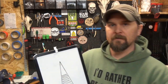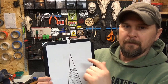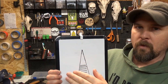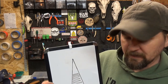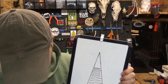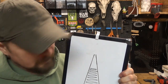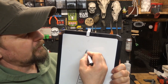That edge does not hold up under heavy use. It is very sharp and very good for certain things — cutting into green wood or clean wood — but any abuse, and because of how thin it is and the lack of support, it will roll. And if you continue to use it once it starts to roll, you can actually chip chunks of metal out. So what we want to do is very simple: we just need to reprofile the edge with a small secondary bevel.